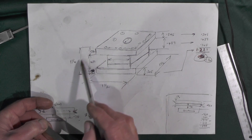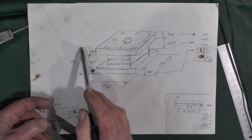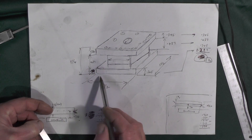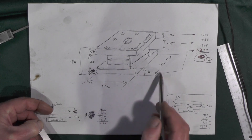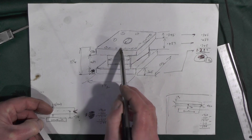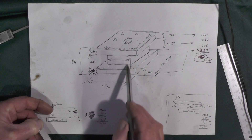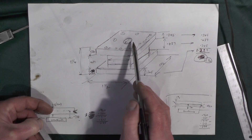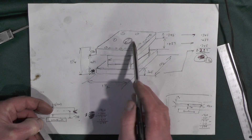I've worked this size out to get me up to inch and a quarter just to keep the sizes uniform. I'm going to look at a piece of one-and-a-half inch square by inch-and-a-quarter thick, and then I'll put equally spaced holes all the way around to clamp the tool, with a hole in the centre for the clamping bar that fits into the compound slide.